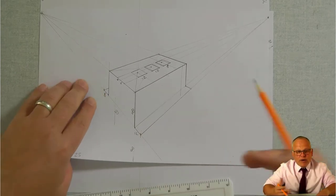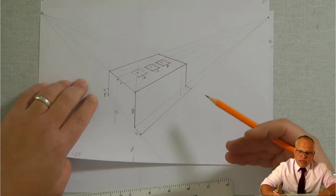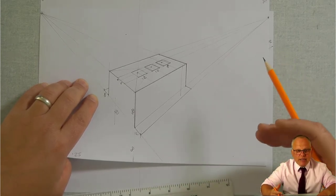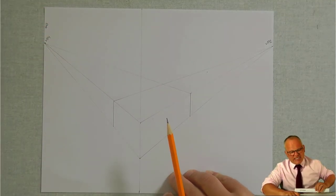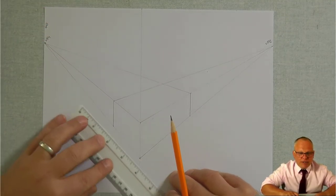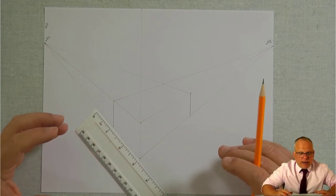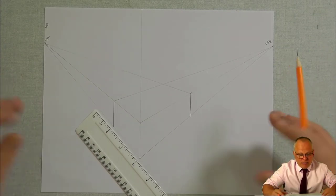So in my head, when I was coming up with this, I was thinking this is a sheet metal project, or potentially a piece of line bent acrylic. Maybe it's been laser cut. So if it was metal, that wouldn't be able to be laser cut necessarily. It would be probably plasma cut, or it would be pressed and punched. If it's acrylic, it would probably be laser cut, and then it would be line bent using heat.